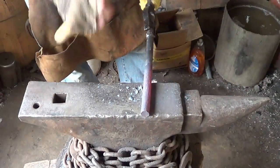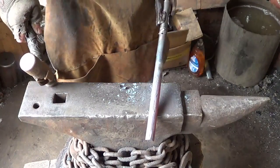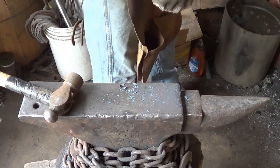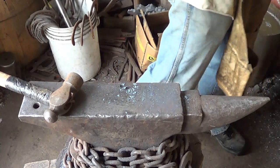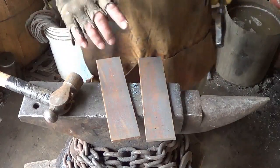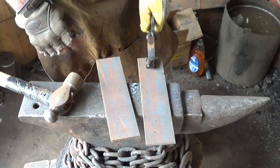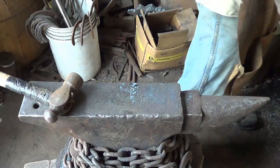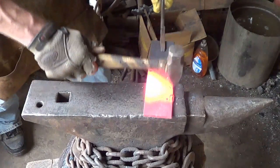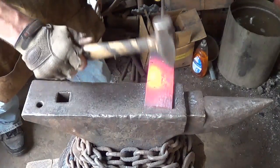I already have two pieces that I can use. With just the two-pound hammer it looks great, but if you go back and throw in just a couple of dimples — nobody's really gonna see these risers, but just to give it a little more character. That's all we gotta do. For my back plate I have looks like 3/16 by two, two-and-a-half. I'll cut these off, bevel the edges, and then put a tree bark texture on the inside. The two-pound hammer — just gonna put in my longitudinal tree bark lines, just for some texture.